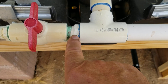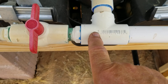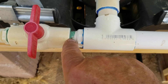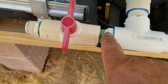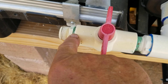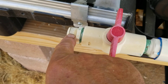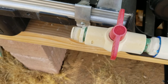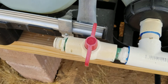Here was a one inch street fitting — that's the one that slides inside to a three quarter male thread — and then this threaded onto that. Then this is a little adapter that's three quarter male pipe thread to hose bib connection, or male hose, so you put the female end of the hose on there.